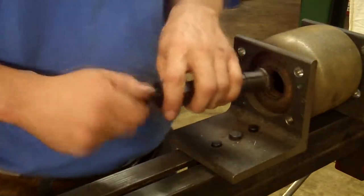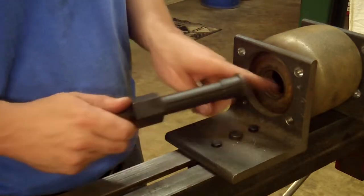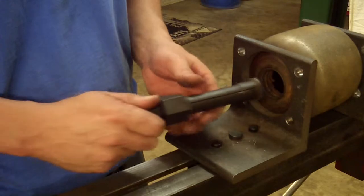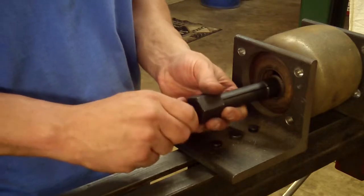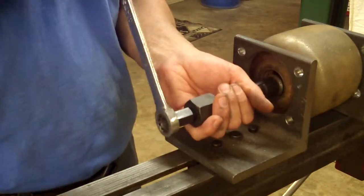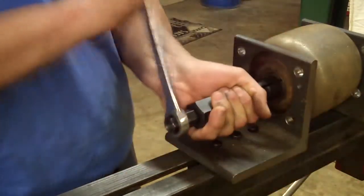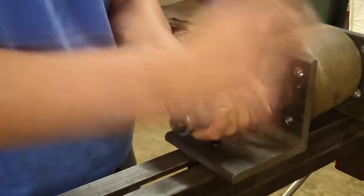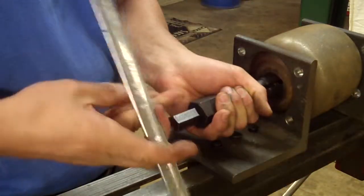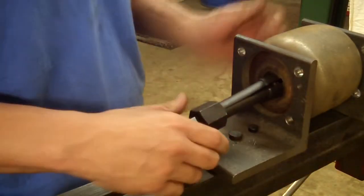This is our 1¼ to 1½ inch collet. It's our most common size. You cannot get behind this bearing race, so we're going to expand the collet so the lips are going to fit into the groove where the balls once rode. Expand it until it stops.